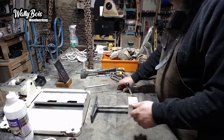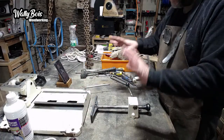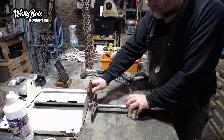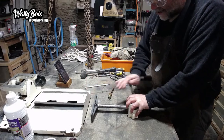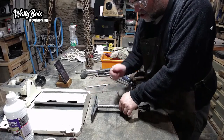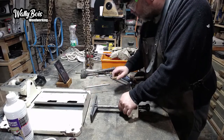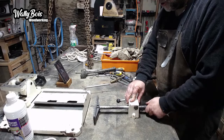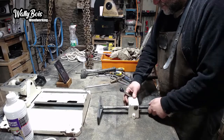But one of the problems you have with these machines is any slack, any movement in the machine at all, such as in these dovetails. What happens is, as we try and pull the chisel out, the chisel is trying to be pulled out and it's grabbing the side. There isn't that much pressure here, because it's not screwed down against the fence like a G-clamp, so it can actually crank the piece of wood. There's a bit of poor design in it. In some ways it's great, it's quick. You can just move along, really quick and easy, because it's locked off. Well, not locked off there, locked off there. There, or is it there? There, it's locked off. So, yeah, anyway, we cleaned it all up.